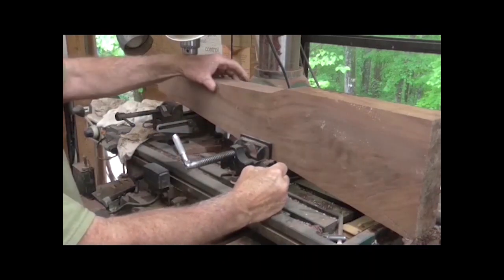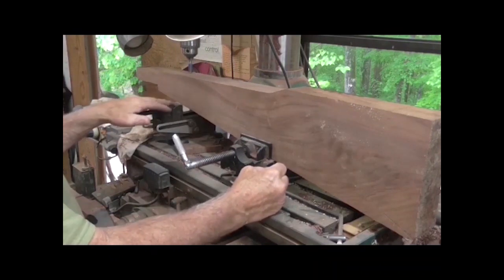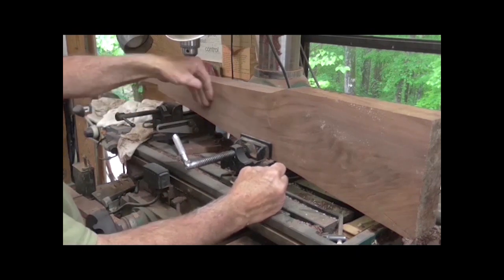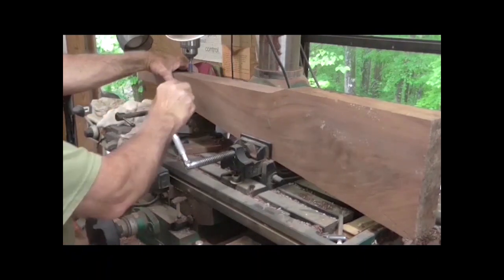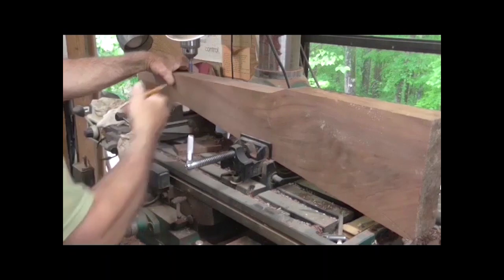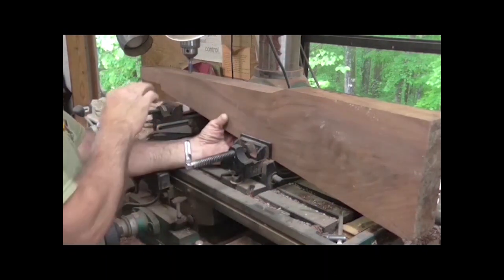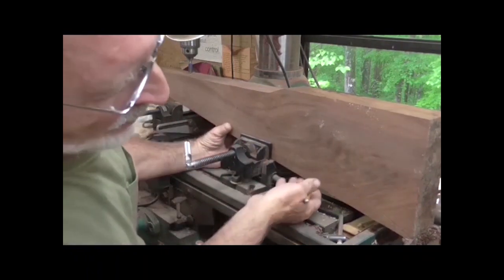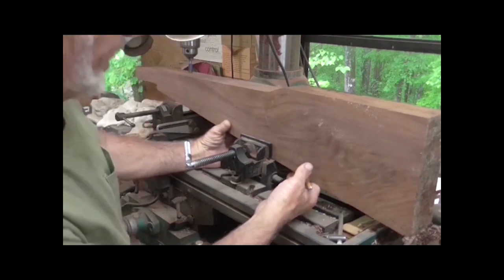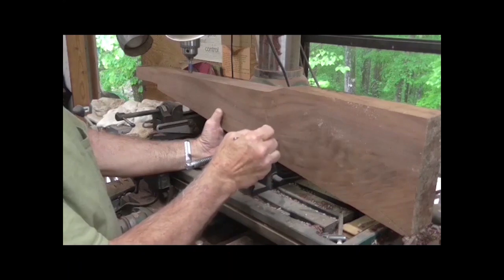Next thing is, this is 2 5/8 wide. This is a 2.5 inch vise jaw, 2.5 inch capacity. I've got to take 1/8 of an inch off of this side, back to along in about here, at least right there, to make it fit in this. So that's the first thing, is get this thin enough to fit in there, and also take out about 1.5 inches, give or take, in here. It's got to be about 1.5 inches higher.